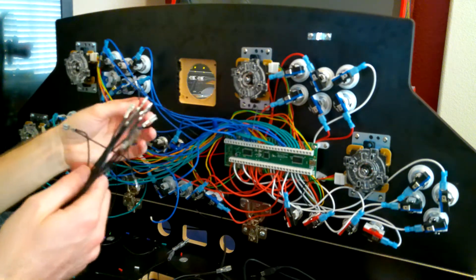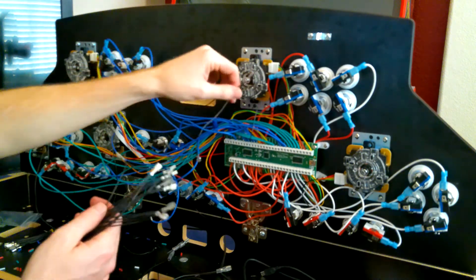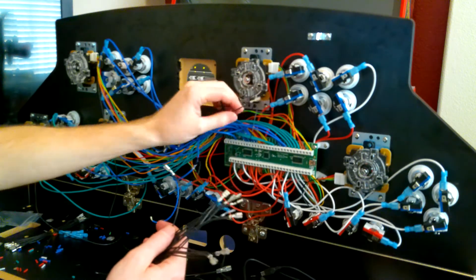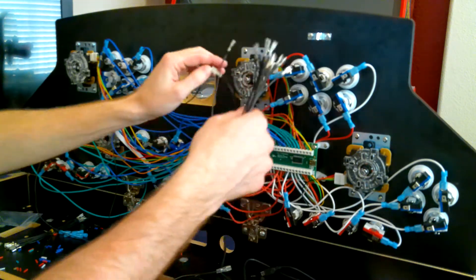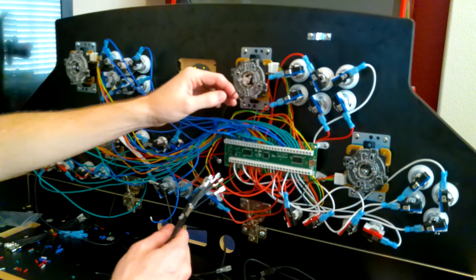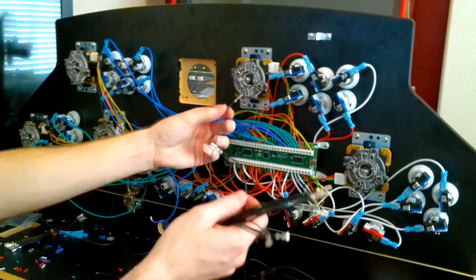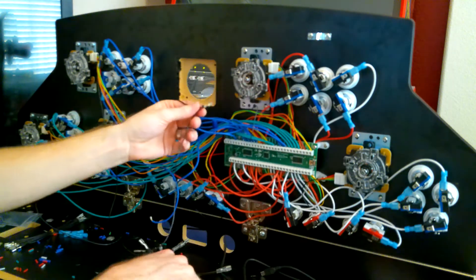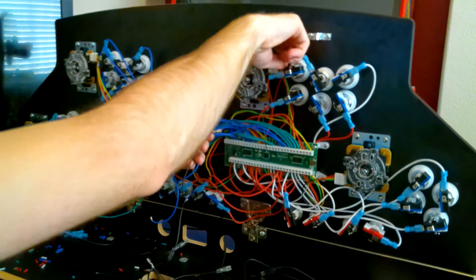So now this whole wire is grounded. I can just connect it to each thing, and every time I ground it to that thing, it becomes connected — and the next, and the next. Every single item needs to be grounded: the joysticks and the buttons. It has these little hooks to daisy chain; you just connect it to each one as you go through. We'll start with the black wire here.